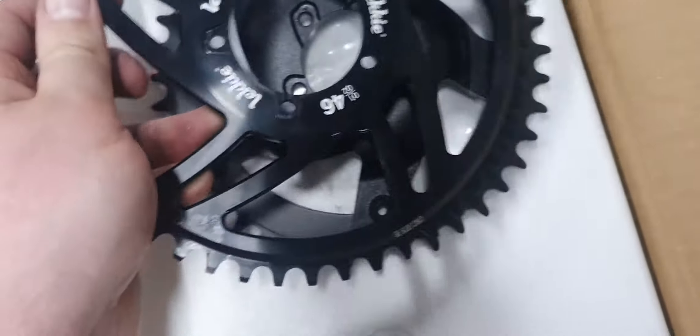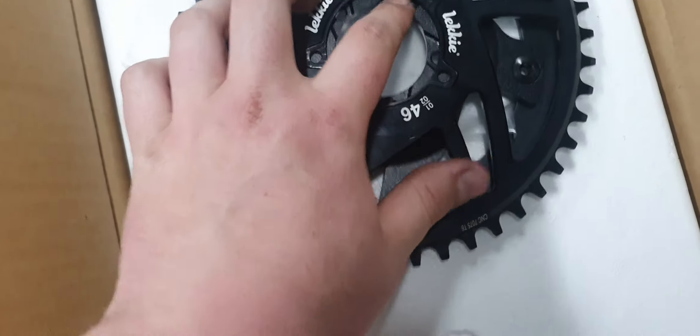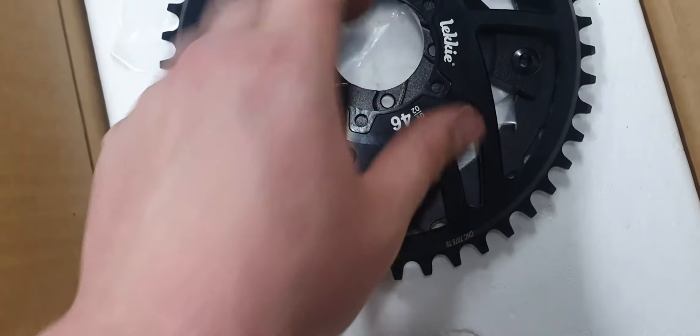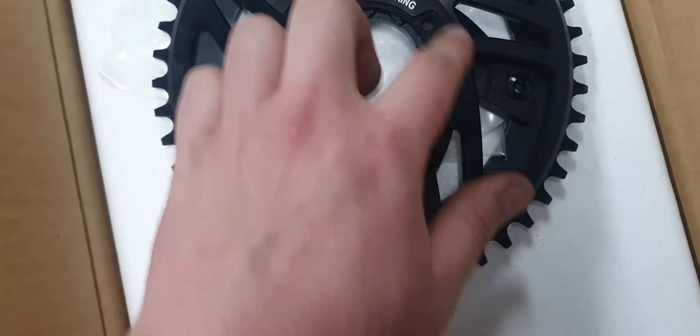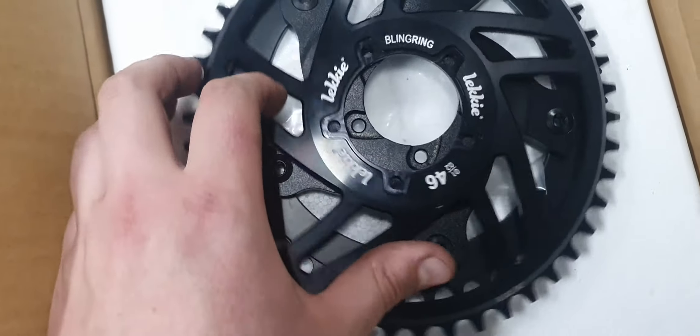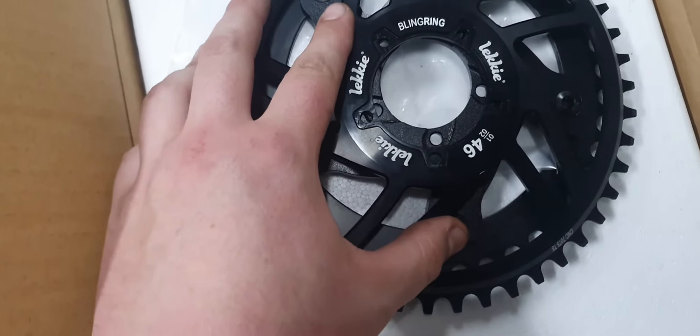If I go this way you might be able to see it a bit better. The spigot diameter is too big — the original that came with the motor is smaller. This one's too big, and also the holes are too big.